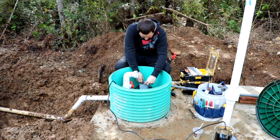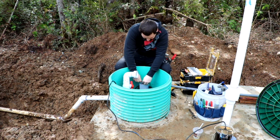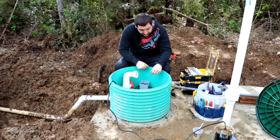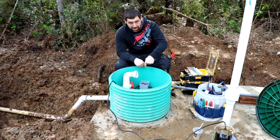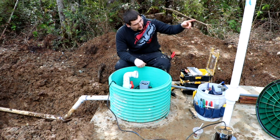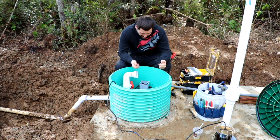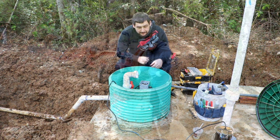So we just groom these babies down out of the way and put the lid back on after we test it. To test it I'm just going to go turn it on, turn the pump on manually, and then I'll cycle the timers to make sure the floats are tripping correctly. I might even pull the float tree and cycle the floats to make sure they're all working properly.